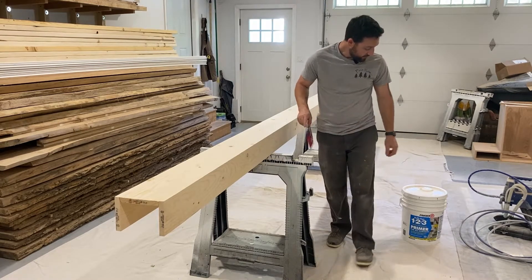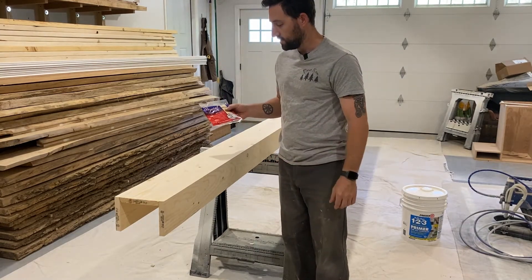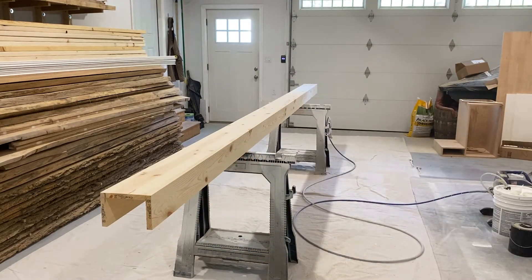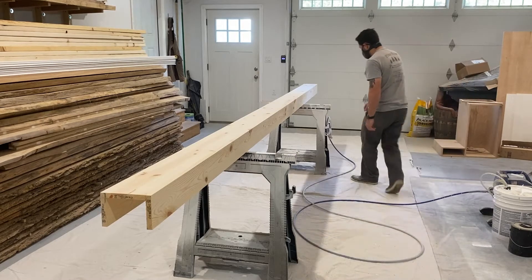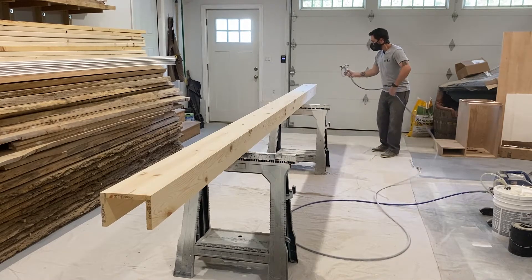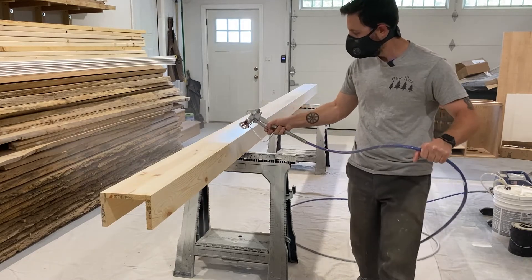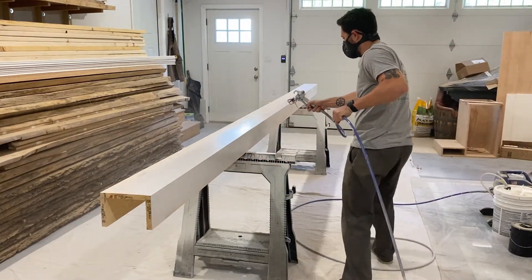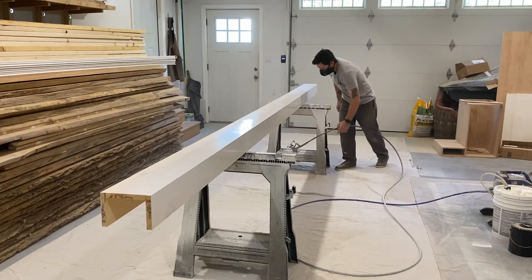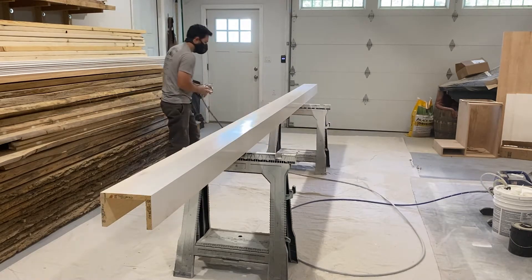It's used for other materials as well. But before I do any painting, I'm wiping every single piece down with tack cloths — you can buy these in individual packs or big packs. All I need to do for the first coat is two quick passes over all of the pieces.